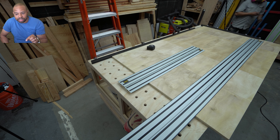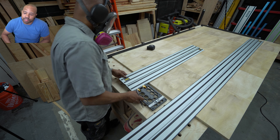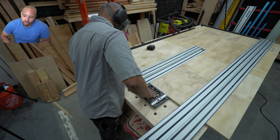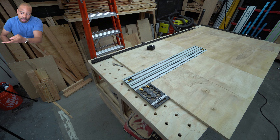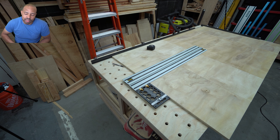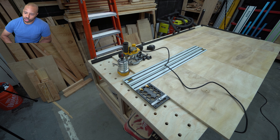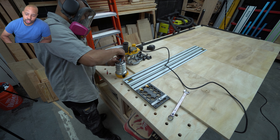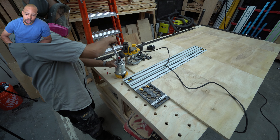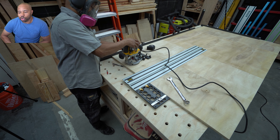I got the long 102-inch rail out because I was going to use it to complete the dado down all of these pieces of plywood. However, I realized quickly that I'm going to have to go through the fence at the far end. And I can't square it up the way I can with the small rail — because I'm not taking the cut strip off one side of my 102-inch rail, I can't use the Bench Dogs rail guide on that rail, so I'm stuck using the 42-inch right now.